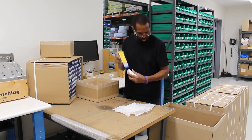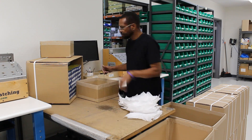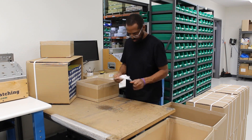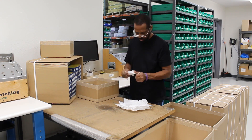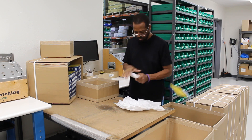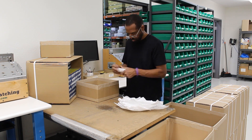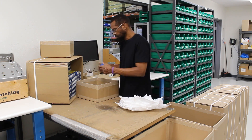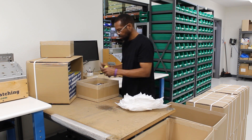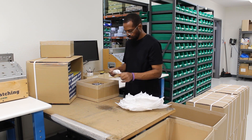This is why brand matching and date code matching are pointless efforts if the tubes do not match electronically. Precise hardware and software are crucial in the process and Apex offers the highest levels of accuracy using modern technology designed specifically for audio vacuum tubes. Precision matched power tubes are an essential component for optimum performance in push-pull amplifiers, providing lower distortion and higher power and efficiency to better capture the natural tone of your sound.